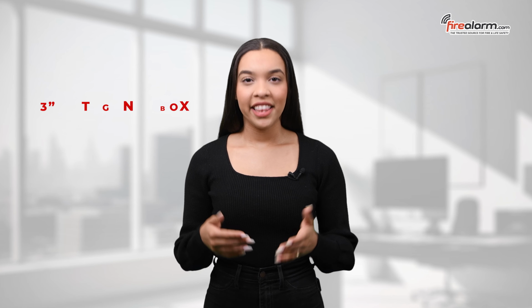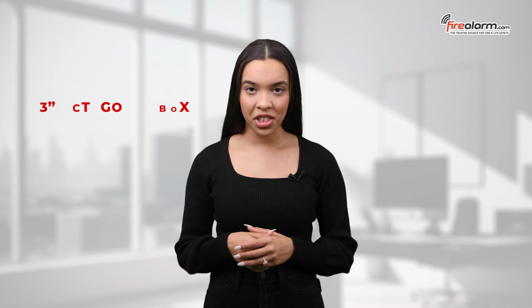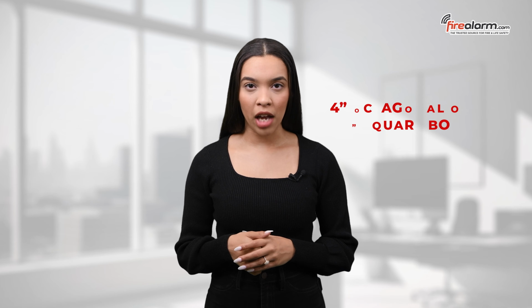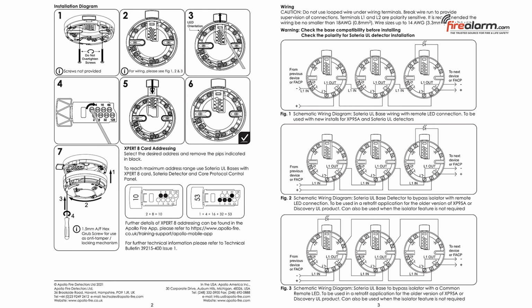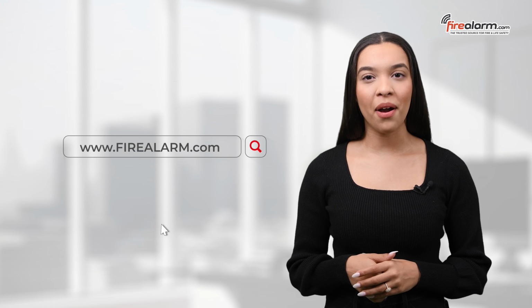In this case, this could be a 3-inch octagonal box for a direct connection to the base. A 4-inch octagonal or a 4-inch square box may be used with compatible UL-listed mounting brackets. Please check out the manufacturer's installation instructions for more information. You can find all technical documentation regarding this product or its accessories on firealarm.com.